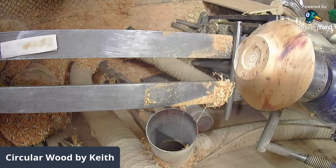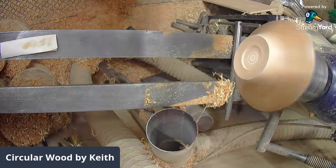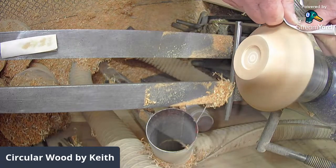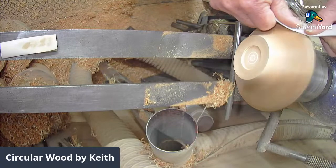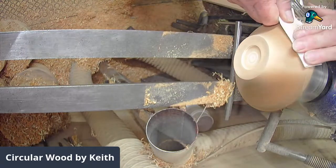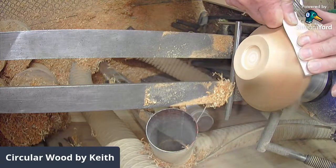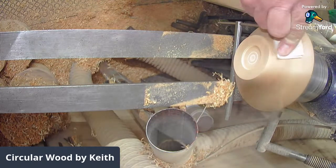Just a little bit round the outside that I just need to get a bit of 120 on. It is only the very last quarter of an inch, where I rushed the chisel off the edge rather than letting it take its time. I pushed it off. So, yes, back on the 240. Yeah, always tempting. You're getting to the end of the run, and you think, "Oh, just a quick push, and I'm there." A quick push, and you're not there because you've got to go back and sort it out.